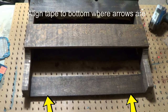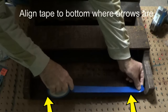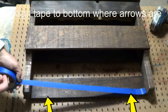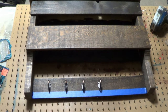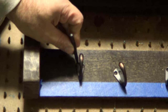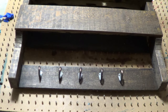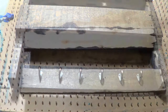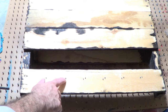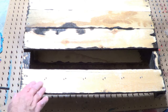To put these on, I want to line them up. Every 3 inches over, so I'm going to go ahead and screw them up. What you want to do is set it where you want it and get a center punch. I flipped it over — I thought my screws weren't going to stick out the back, but they are. So I'll have to take a grinder and grind those down a little bit so they don't scratch the wall.